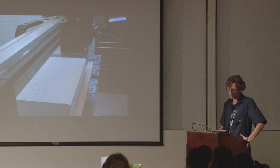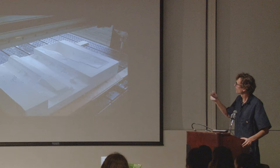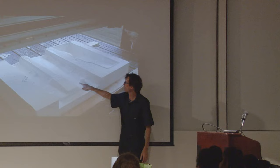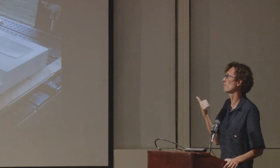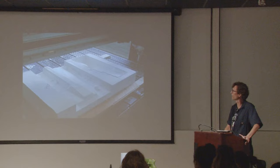You start with a roughing cut, and then you go into smoothing it out, carving out more and more. You can see here, this is going to be one of those registration keys. It's going to get carved one more time so that it produces a perfect hemisphere, but that's going to take a while. That's where I'm going to put my energy and my time. And if I'm spending money on this milling, that's where I'm spending my money too, right? That's costing the most amount of money. So there you can see when that hemisphere finally gets perfectly carved away.